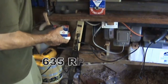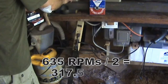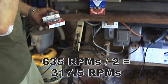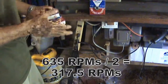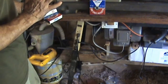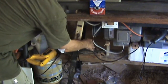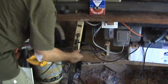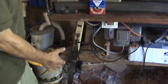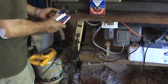Now, I wanted to go back to the original speeds that I listed over here, and I had picked up a crazy configuration, another 5 and another 2.5-inch pulley, which of course doesn't work. And no matter which way you set it up, you have to be able to maintain the same distance between this shaft and the motor, or else you're going to have to alter the height of the motor or the height of the pulley, and you can't do that. You're kind of fixed in these positions.